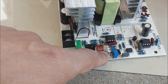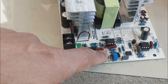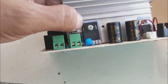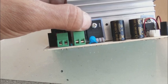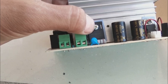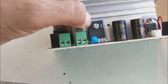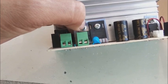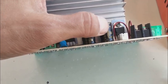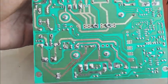Here they have provided two shunts. The fan is here, and red and green LED connections are given for the status indicators. For the output rectifier, they have used an MBR30100 — a 30 ampere, 100 volt rectifier — which is a good rectifier. For smoothing the output, they have given two 2200 microfarad, 25 volt capacitors in parallel.